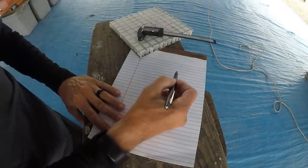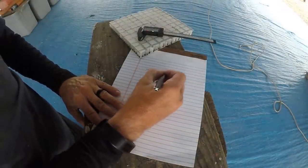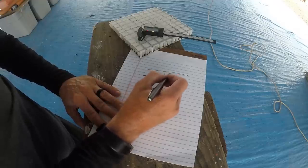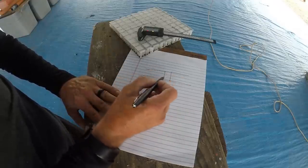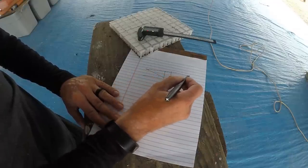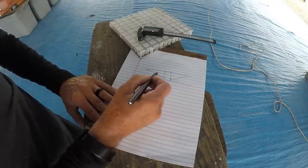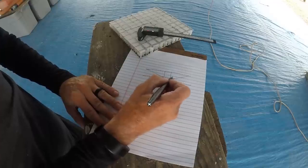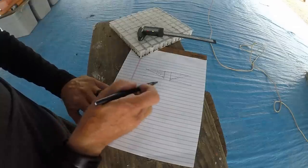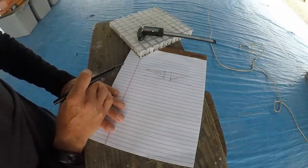Okay. When you're repairing a traditional fiberglass boat and you drill a hole through it, there's your through hole. Now I want to repair the hole. This is a cross section. You grind back the exterior surface and then you make laminations to fill the hole. Makes a nice solid repair.